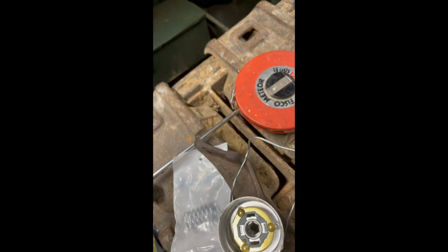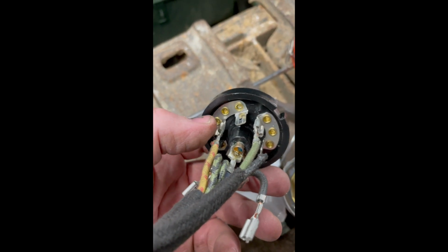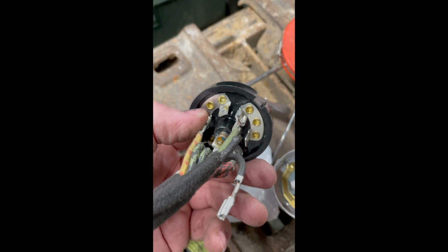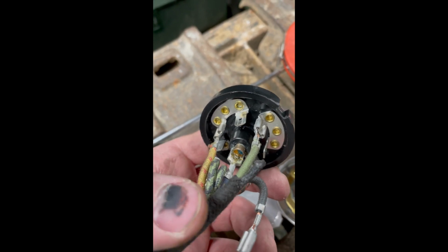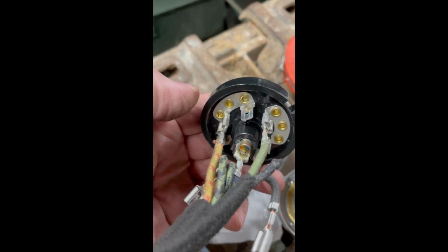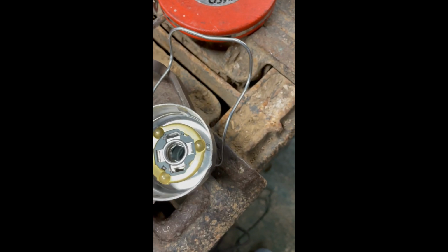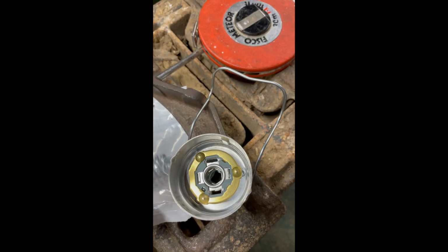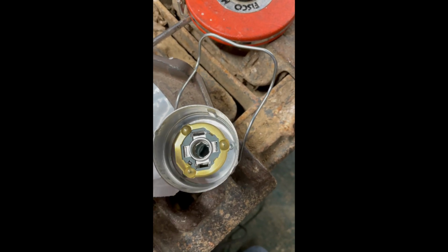So what I've got is, and what I've managed to do, even though it's not quite right, but it'll work. So the power's going to be coming from the Dynamo. Remember, that's either charging this way, or if you've got it switched off and the engine's not revving hard enough, then the flow of electricity will come backwards from the battery back down this way. Now, there's three positions that this should have, which is off altogether, so no charging, no lights. There should be charging only, which will make your ammeter come on just to charge the battery. And then there is the lights on mode, so it's just literally headlights on and the rear lights on. So that's what I've worked out since filming the last little bit.